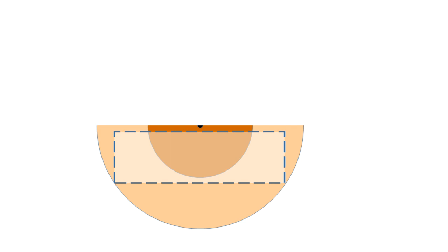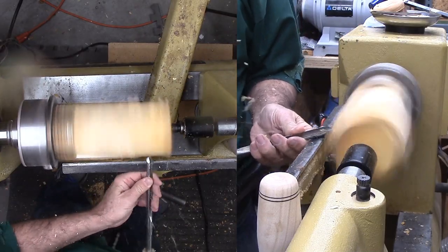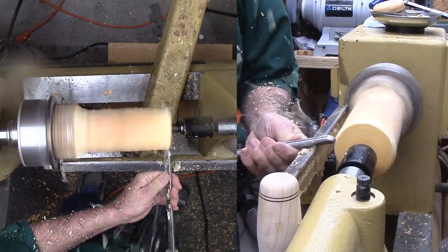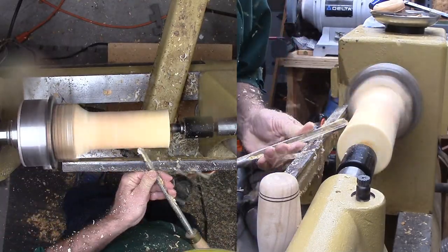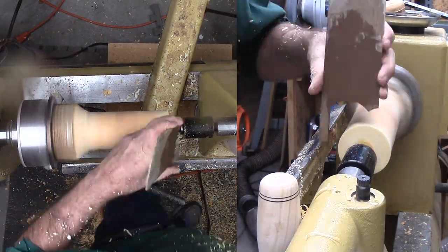Maybe on the next one, I should try including even more of the sapwood. However, then I'd lose more on the top and bottom of the tube to get the square ends. Now I'm mounting my timber much like a spindle, but remembering that this is cross grain. This is actually much more like a very tall, skinny, bottomless bowl. I'll use a bowl gouge to rough out instead of a spindle roughing gouge, just in case. What a shower from wet wood.